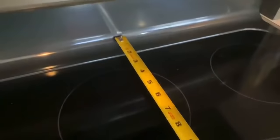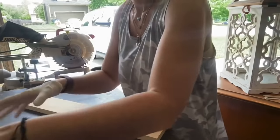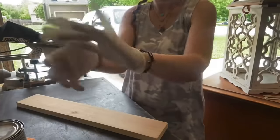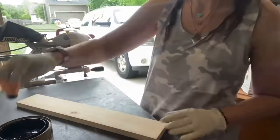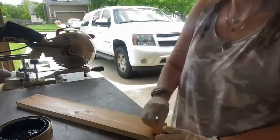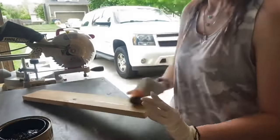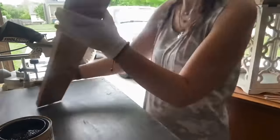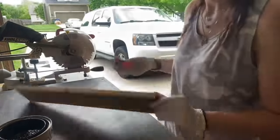We are making a stove top cover. We need to measure the length and width of our stove, including that nice plastic part — not just the inside. I went outside and cut four one-by-six pieces at 29 inches long and two one-by-four pieces at 22 inches long. I'll leave measurements based on my stove model, but it will vary depending on your stove. Next, I'm taking Golden Oak by Rust-Oleum and staining the front, back, sides, and ends of all the wood pieces.